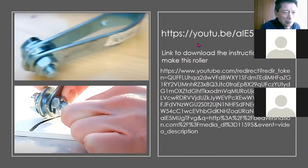There's a YouTube channel where a gentleman did a very detailed design of a coroplast boat. I watched that video many times before I got my hands dirty. He came up with a way of making a roller using a washer arrangement — the thicker the washer the better, ideally about quarter-inch thick, and the edge has to be smooth so it doesn't bite into the coroplast. This is one way to create a folder. Go to that YouTube channel — they have a link to download how to make this roller. I didn't include it in my description because it's copyrighted and I don't want to copy someone else's credit.